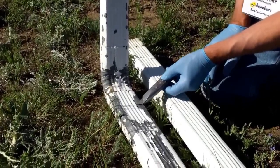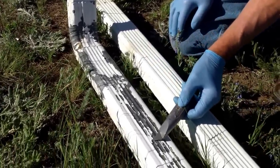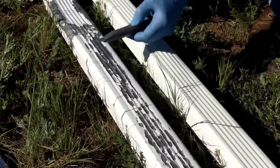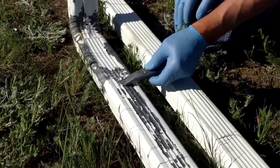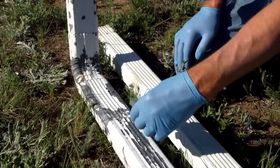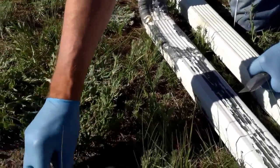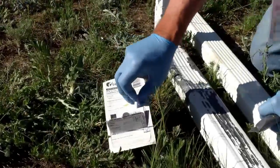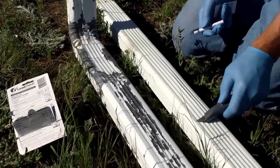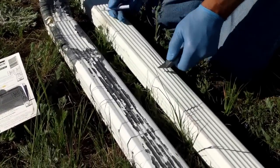The thing you want to be aware of is when the paint is flaking, almost like as if it was made out of sheets of metal, it tends to be lead paint. I've got gloves on because you're really not supposed to touch this stuff. So we have a lead check kit. Next to it, we have another downspout that we know by the age of it has never seen lead paint.